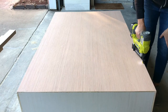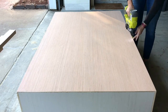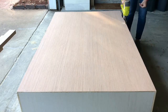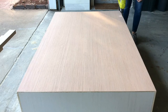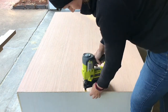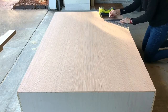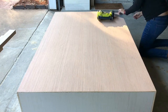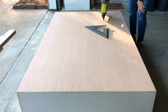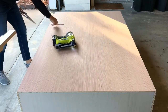Have a wet rag handy whenever you're using wood glue to assemble plywood or lumber so you can quickly wipe away any glue that squeezes out — you don't want to deal with it later when you go to finish your cabinet. I used quite a lot of brad nails along the back to make sure that plywood is held really tight against the frame while the glue dries, and I got my square out to line up where the shelves were so I knew where to put the brad nails along the back.